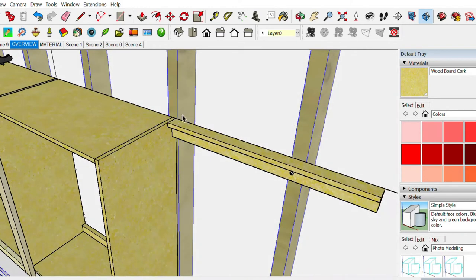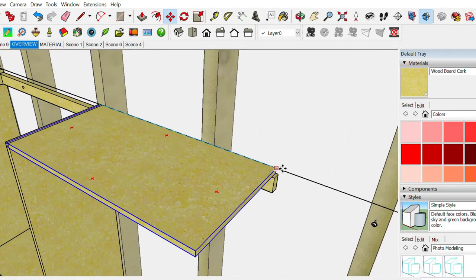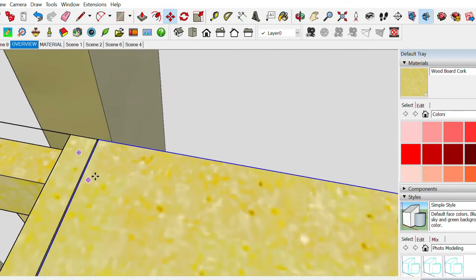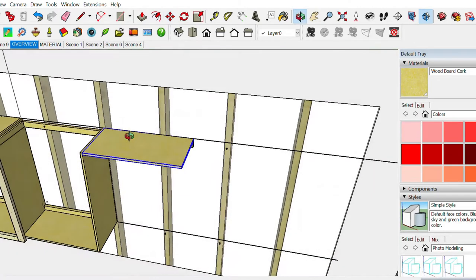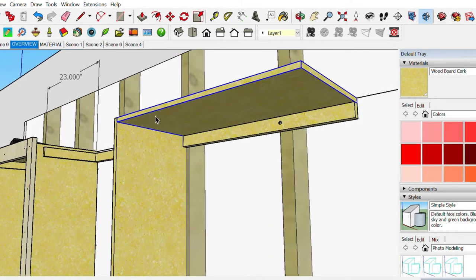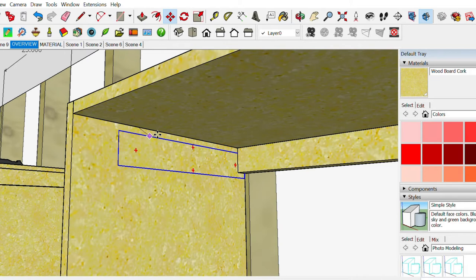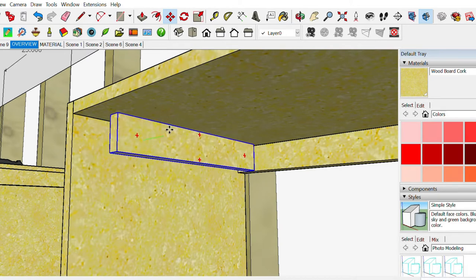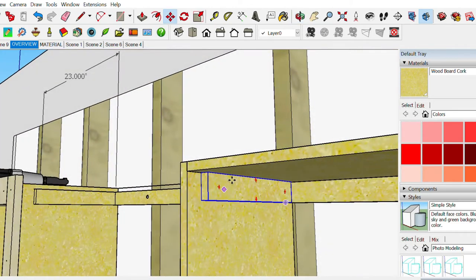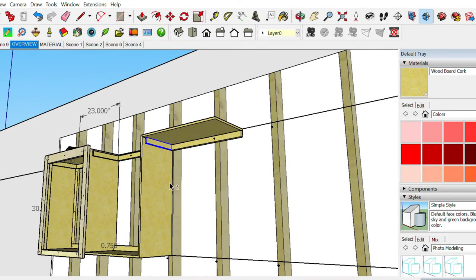Since you now have something stuck on the wall, you use it as your pivot point — just rest the sheet up on there like it's a shelf. The only problem is nothing is supporting it over the depth of the shelf, so you just take another cleat and put it right there, tack it down, and your shelf is held up. Then you keep going with the pattern, building upon one side at a time. It gets easier and easier — you get into a routine. Do the top first, then a side.